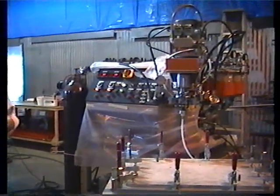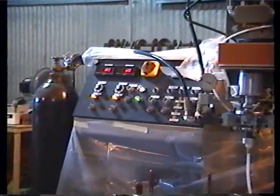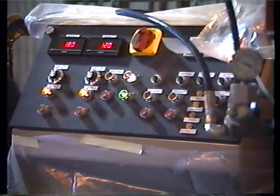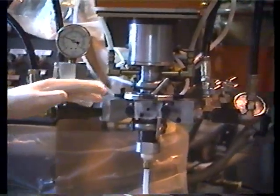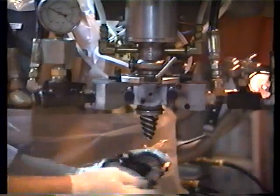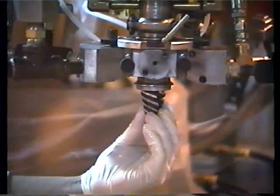That ratio is 100 parts to 39. The pumps — this piece of equipment has been sized for a particular ratio close to two to one, which is why you have almost a match on our pin, similar to the equipment we'll be supplying for you. On this board we're using a NAU Series 200 mixing head with what we call our reduced air entrapment and reduced volume impeller. It's a high-speed dynamic mixer driven by a two-horsepower AC drive running at a little over 3,000 RPM. The conical shape is an excellent mixer and creates a pumping action to reduce back pressure, so we're able to fill this board effectively.